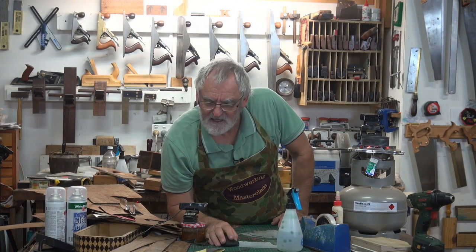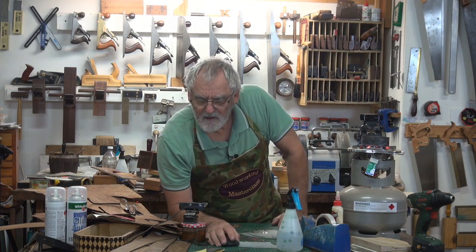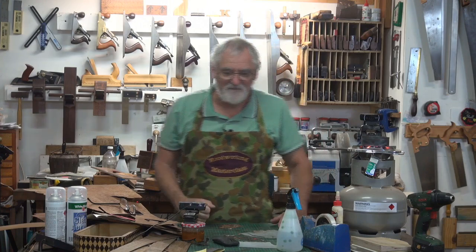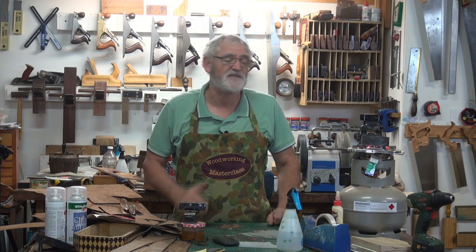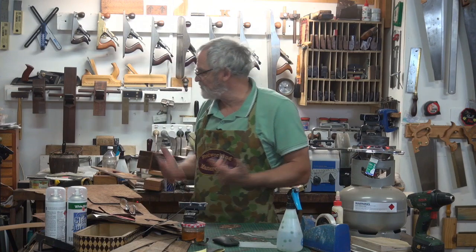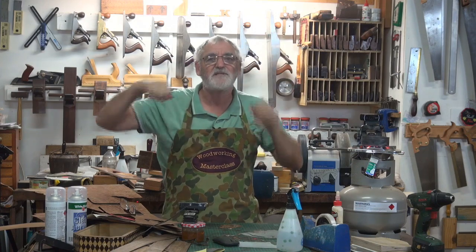Hey, Steve, before I forget, any tips on keeping a large box or rectangle square? Yep, build it square. There was a bloke on blacksmithing, I've forgotten his name, but he said, if you want it perfect, just build it perfect. If you want it square, just keep it square. It's constantly checking. Check your diagonals, that's the best way. So if you've got a box, any square thing, you get a tape measure diagonally, check that distance, check the other distance,